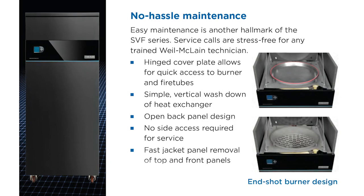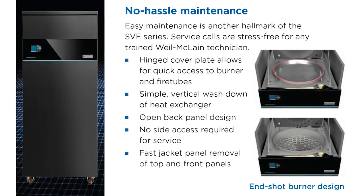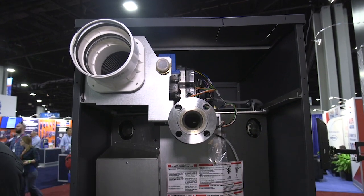On the top, we have eight bolts. You pull those eight bolts and you can lift the burner section up. That way, it's easy for the serviceman with a simple stepladder to get in, do maintenance on each boiler, and move on to the next. One of the unique things we have is a removable pan on the bottom of the boiler. With eight bolts, we can remove that pan and pull it out almost like a drawer — you can clean it, check it, and maintain it. And later down the line, 10 or 20 years, if that pan happens to go bad, it's easily replaceable.